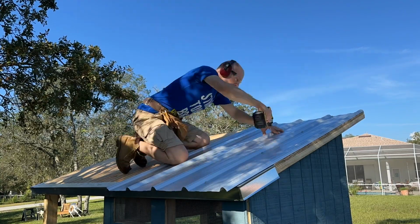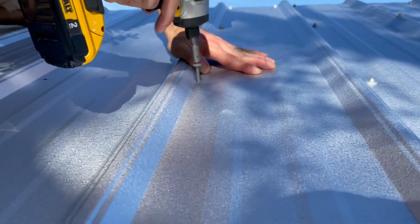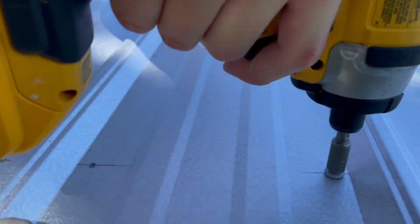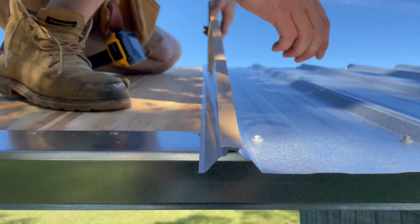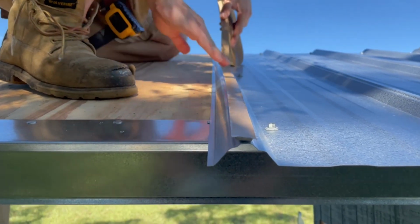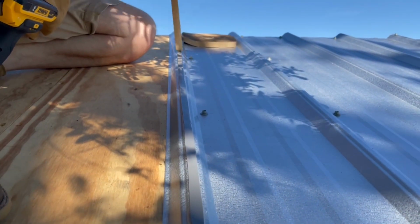The large roofing panels get installed next. They're held in place with special screws with integrated rubber washers. The screw placement is dictated by local building codes, so be sure to check what's required in your area. Where 2 panels overlap, be sure to apply a strip of butyl. It's a sticky rubberized material that will block water from seeping between the panels.